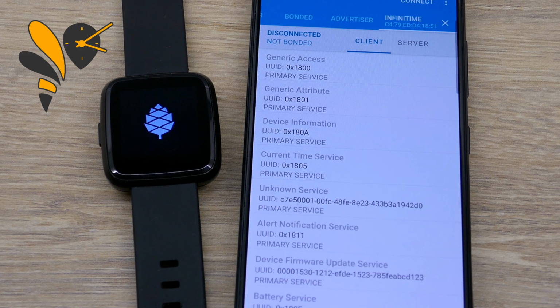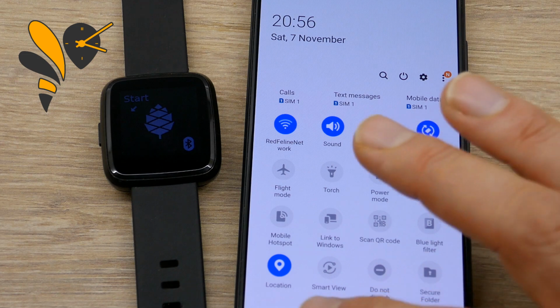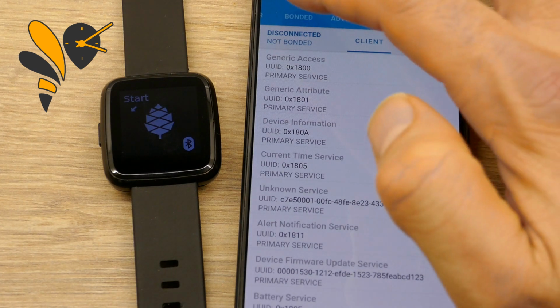So it'll be another 5, 6, 7 seconds from that white pine cone to the reset. That's actually a watchdog timeout. And at this stage, it's now about to jump into the wasp bootloader. This is not a blue pine cone, this is a white pine cone, but the backlight has gone right down. Because the wasp bootloader sits here with the backlight on waiting for instructions, I set it to run at the least brightness possible. In fact, if I take the brightness down on the phone, the camera might start looking a little bit whiter on the other side.